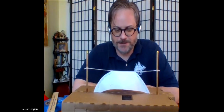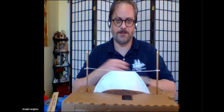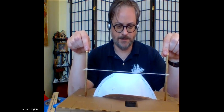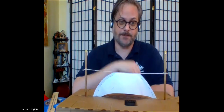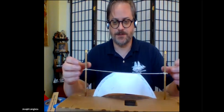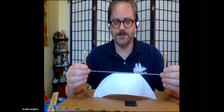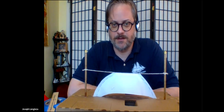all right, so let's pretend this is a full-size watercraft like we have at the museum, but we don't have on Zoom. The way you would record these lines is, if you possibly can, turn it upside down. It'll be a lot easier. Then as close as you possibly can to along the axis of the keel. If it's got a flat keel, you can use the keel itself, but as close as you can to that axis, run a tape measure. I don't know if it shows up on camera, but this particular piece of string is marked out in half inch increments. We'll call that a unit for the purpose of this. And you're going to measure out unit by unit and make a grid of what the shape of the vessel is.